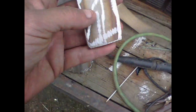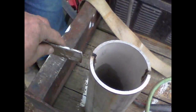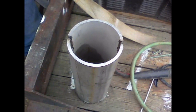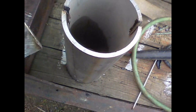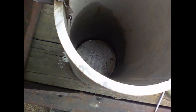I got two plates, they're about three inches long by an inch and a half. We're going to do two fillet welds on the side — this will keep the crucible from falling down in the furnace. This sucker already weighs about 15 pounds by itself, so we took a grinder and ground two grooves.